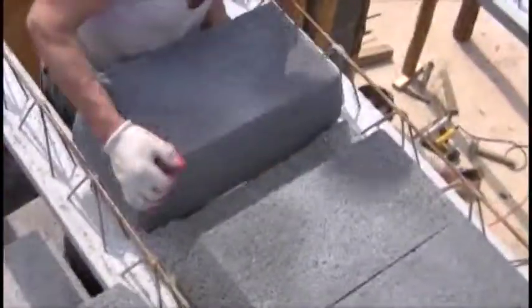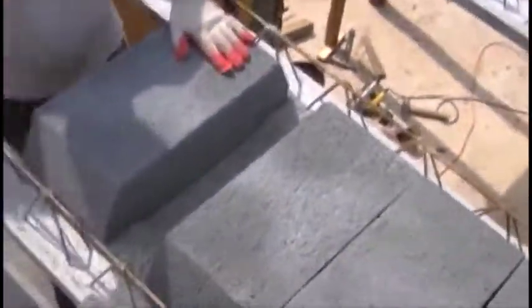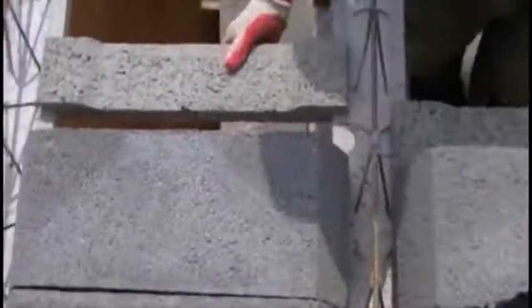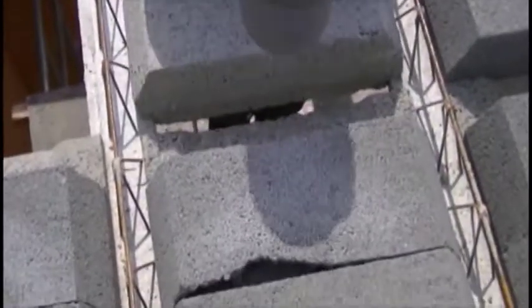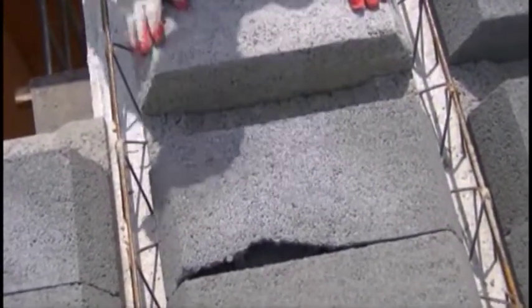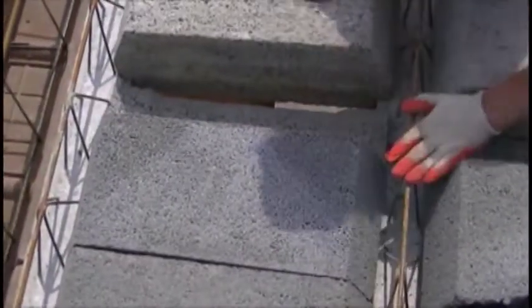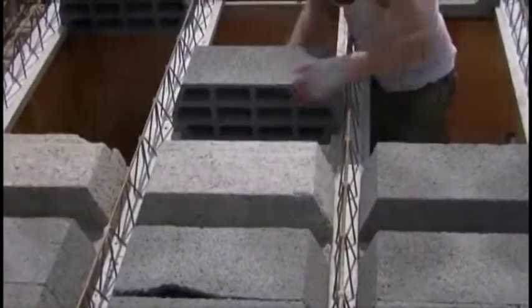After 8 hollow blocks we have the next distribution rib. We put here one-sided closed blocks, that is exactly as you see. In place of the distribution rib a gutter is formed. The reinforcement will be linked with the reinforcement of the joints. In this way reinforced concrete beams create a grate, which will form a monolithic structure combined with the wreath, columns, footings, and as you will see in the next chapter, also with lintels and external columns and reinforced concrete slabs.